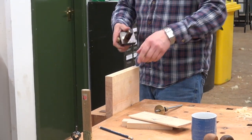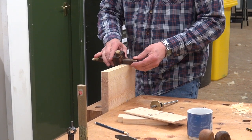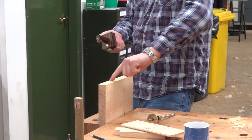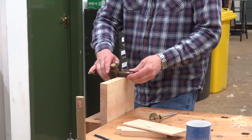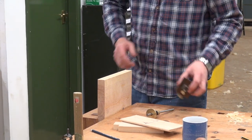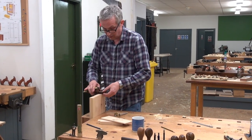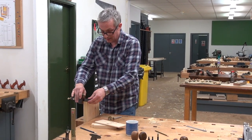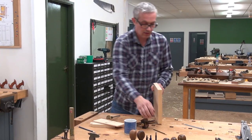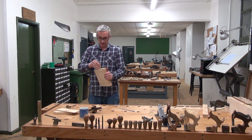Just set that up, setting it into the existing line. Now this spike tends to follow the grain, so what you have to do is roll it into the cut — you're actually cutting with it. Roll it into that cut nice and lightly, put a nice light cut on. The stock is resting on the face, this runs along the timber, push it nice and tight to the face side. Roll it into that cut — it gives you a slightly easier-to-see mark. Drop your pencil into that line to make it a little easier to see.